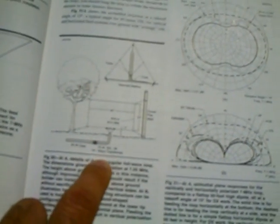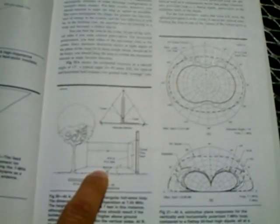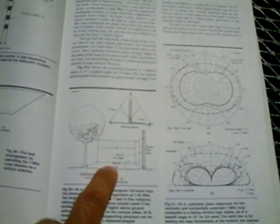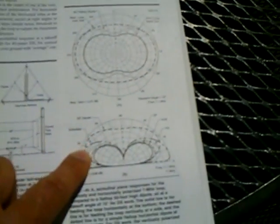This is the picture here. I did it slightly different than what they had - I made the loop bigger, made it go into the 80 meter band. I have about 250 to 260 feet and it just puts it into the 80 meter band, around 4 megacycles. These are the radiation patterns that the antenna can do - that's with the square antenna.